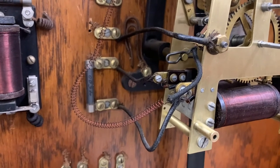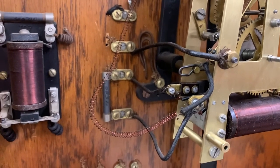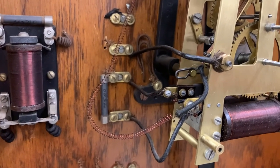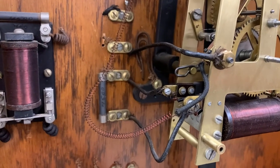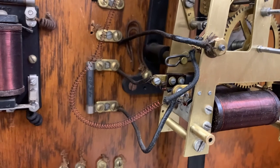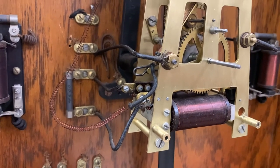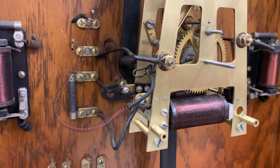The modern way to do this would be to use a diode — an electrical device that conducts current only in one direction. You attach it similarly to how these resistors are placed: when you apply power to the solenoid, power does not flow through the diode and only flows into the coil, but when the coil releases, the back-current flows in the other direction and the diode shorts it out, eliminating that extra arcing. I think we're pretty well back to spec, with just a little more to do on the timekeeping side before we look at the mechanism for the bell tape.